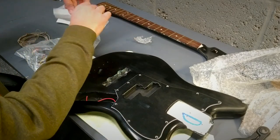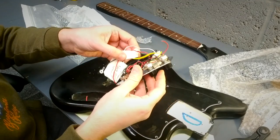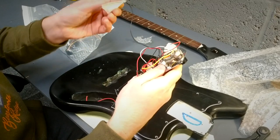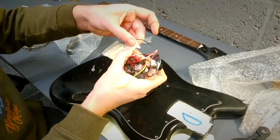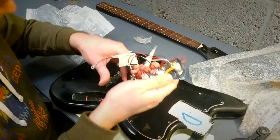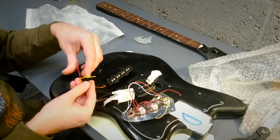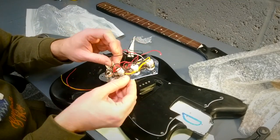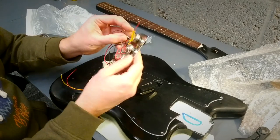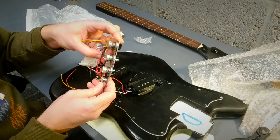This should be the control panel in this bag - it's marked what's what. Neck pickup ground, bridge pickup ground. There are screws in there for those blocks of solder. I've just got the jazz bass pickup in - one will be ground and one will go to the volume or tone. That would be the volume control for the P bass, jazz bass, and that's the tone. That should wire in fine - shouldn't be a problem. This little panel covers that gap there - looks sweet.